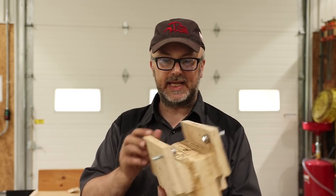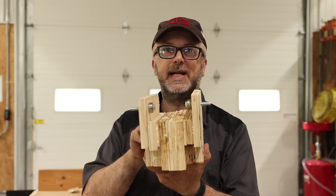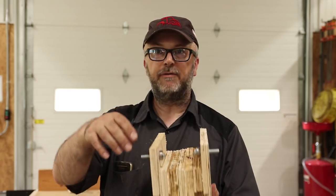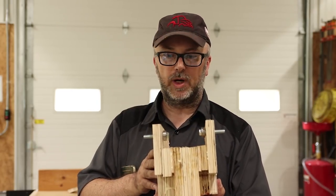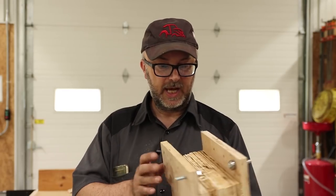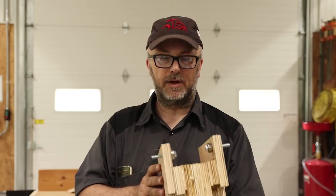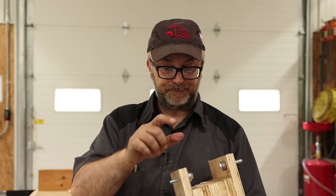It's not pretty and it's got glue all over it, but it's going to be strong. Essentially I've made a giant solid block of plywood. I've inserted two of the bolts with the roller skate bearings for now — it fits on the track nice and snug, almost a little too snug in places. I think I'll need to polish the edges of the track with the grinder and knock the edge off — then it should be perfect. It's snug enough that it doesn't rack side to side, which was one of my concerns. Even something 50 pounds on your head is going to hurt, so I don't plan on standing under it. I don't have enough bearings yet but they're supposed to arrive in the mail today.